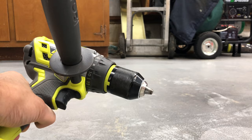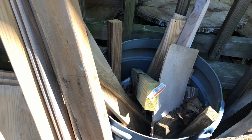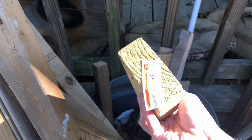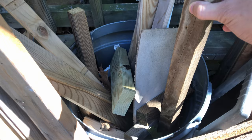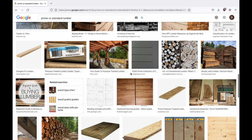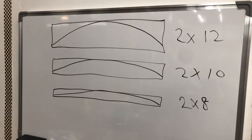Moving on to the stringers — I'm going to refer to the joists as stringers. I'm using pressure treated ground contact wood. This is the stuff that lasts a lot longer when in contact with direct soil. It's usually wet and heavy. When you're in the store, you're going to find all sorts of warped pieces, and you're going to have to take them out one by one and make sure it's a good piece. Sometimes they're not the proper length, so take your time there. You're going to run across the words prime or premium and standard. The premium or prime lumber usually looks nicer — there are fewer knots. Whether the price difference is worth it to you, you're going to have to figure that out.